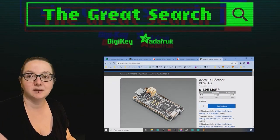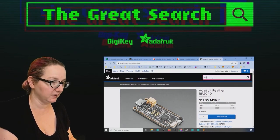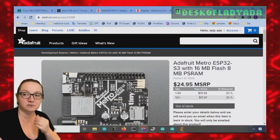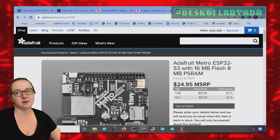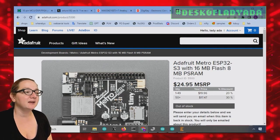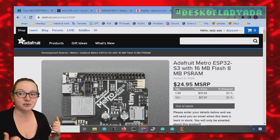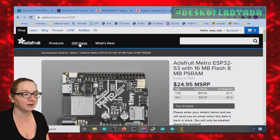Lady Aida, what are you looking for this week? So a few weeks ago we talked about these SWD connectors. We were showing off the Metro S3, and it has a 2x5, 10-pin, 0.05-inch pitch connector that's often used for SWD but can also be used for JTAG. SWD is ARM Cortex only, and it's how you can program the chip directly — even if you don't have a bootloader, just a raw chip. Also great for step debugging and tracing.